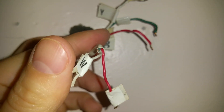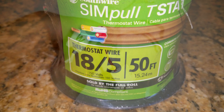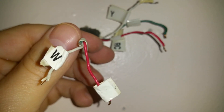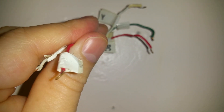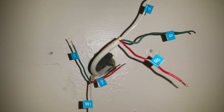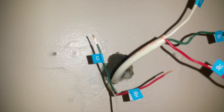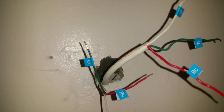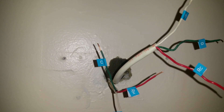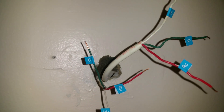If you didn't have that extra wire, another option is to get a new thermostat wire that includes a C wire. You'd tape the new wire to the old one at the thermostat end, then at the furnace or AC end you'd feed the new wire through. I went ahead and relabeled everything - Nest includes labels, so I put C on that green wire so anyone doing future work knows I'm using it as a common wire.